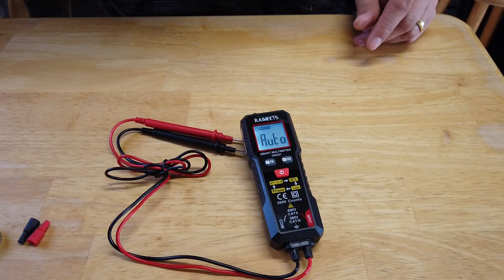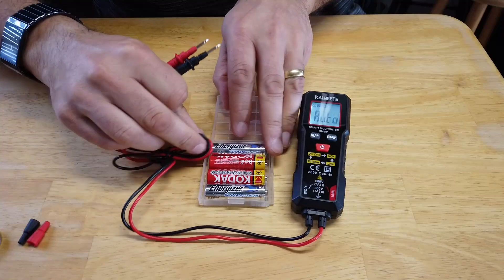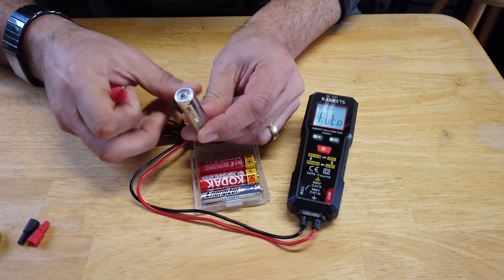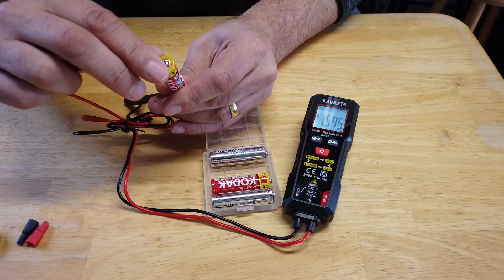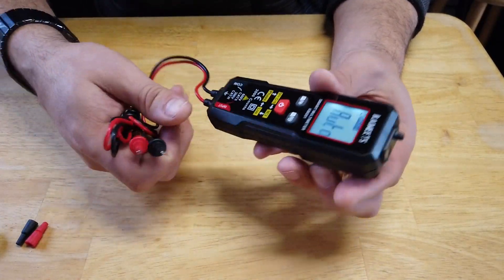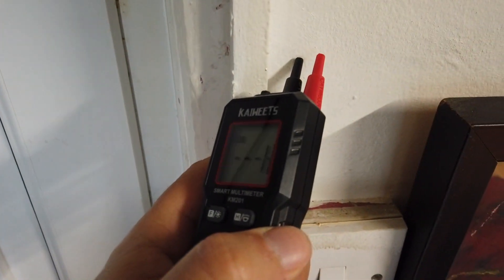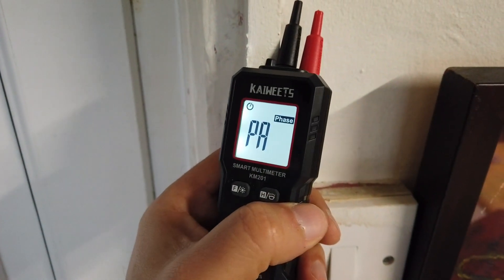It reads voltage nicely. Let me get a battery — let's just run through a bunch of these batteries real quick. These are Energizer lithium batteries; they last for quite a long time. Let's get our scope probes the correct way around. That's at 1.664 volts — there's a good reason for me to keep these batteries. They all look like they're doing okay, so 1.5 volts for that one. It also has near-field mains detection — press the button once and it switches into mains sensing, and it shows you what phase you're on as well, which is interesting.